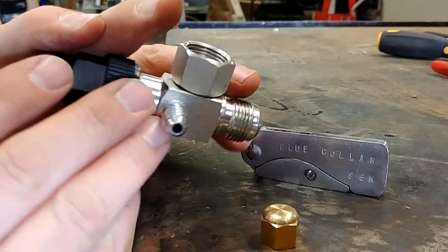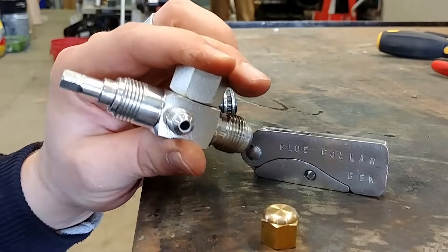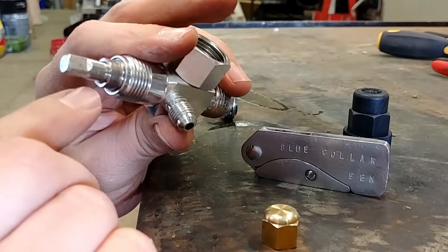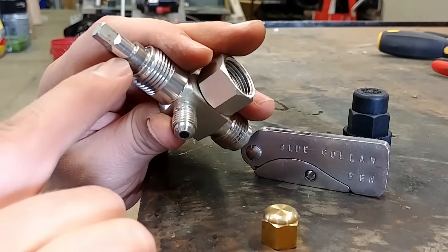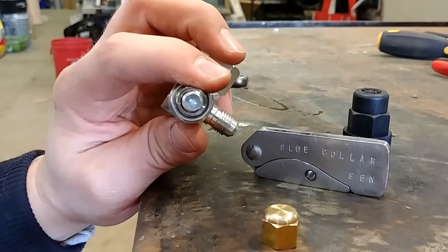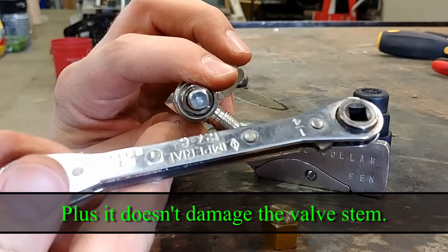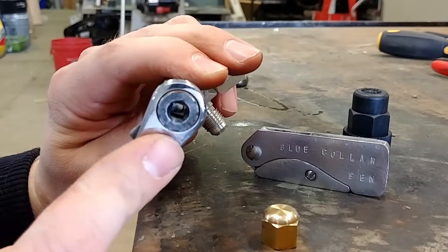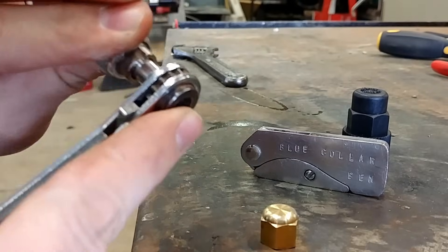What you have to do is take off this cap here on the top, and don't lose it because that helps prevent refrigerant from leaking out if there's a small leak right up here at the top of the valve. There's a little stem here with a square top, and if you have one of these wrenches it's a lot easier to open and close — I will link to this wrench in the description below. In this case it's a quarter inch sized square on top.